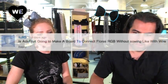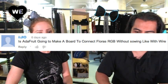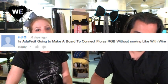All right. Next up, is Adafruit going to make a board to connect Flora's RGB without sewing, like with wire? This was a comment on last week's show when the component was Flora NeoPixels. Yeah. You can solder wires to Flora NeoPixels. In fact, in the headphone project we did last week, the heart rate monitoring project, we soldered the NeoPixels. So you can freeform wire the Adafruit NeoPixels. You can also use NeoPixel strip, which is all of them already in a row that you would connect with wires, because there are so many that you wouldn't want to run that much power through conductive thread.